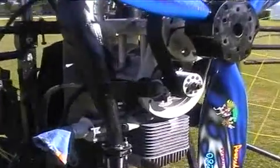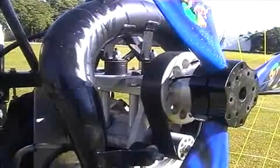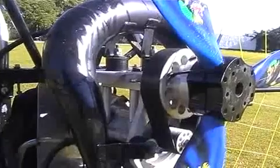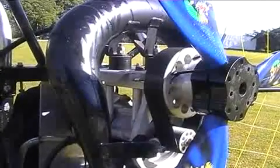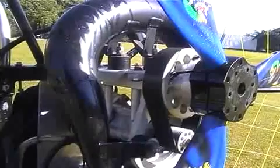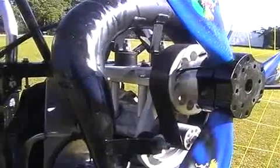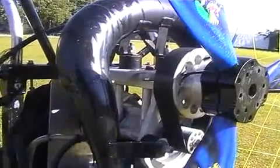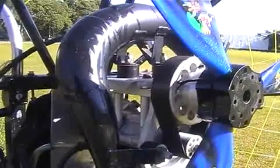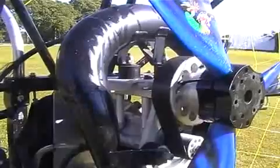So what we do is we bolt a small pulley onto the crank, and it's geared down via a big pulley that you can see directly above it. The prop is then bolted directly onto the big pulley, and depending on the reduction ratio between the small one and the big one, for example, if it's 3.5 or 4 to 1, in other words the big pulley is 4 times as big as the small one, the prop will be governed down or slowed down 4 times. So your 16,000 RPM from the engine will be governed down by a ratio of 4 to 1, which would make it 4,000 RPM. Now that's still pretty inefficient in terms of propeller RPM is concerned, and we need to keep it down to 2.4 to 2.8. So one would govern it down, or make a big pulley or a small pulley.